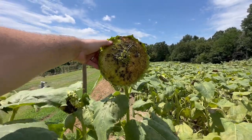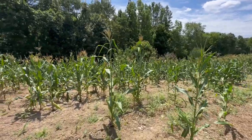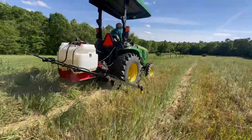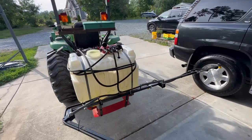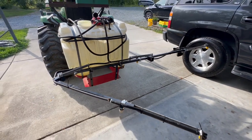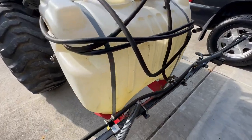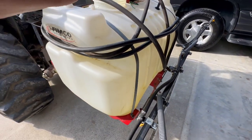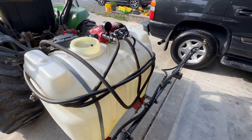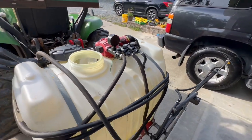So there you go, that's our setup. Everything is relative — we're running a pretty small farm, only about three to four acres actually under tillage. So this 40-gallon electric sprayer does the job, but we're pretty much maxed out on its capabilities. If you went to five, six, certainly up to eight, nine, ten acres, you would not want this electric sprayer — it's going to take forever. Highly recommend you upgrade to the hydraulic PTO-driven pump. But that's our rig: upgraded with a bigger pump, arms spread out to get a wider 12-foot pass, it's worked great for three years. I recommend not putting the bolts into the bottom that secure into the tank — that could cause a cracking issue. Just use the metal bands, they are plenty sufficient. Upgrade your pump, get a higher output, and you should be good to go.